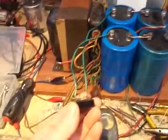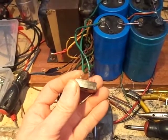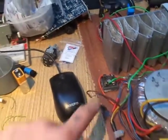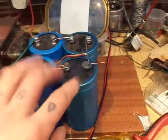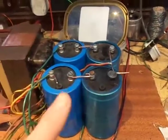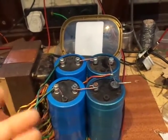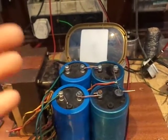I was wiring the bridge rectifier yesterday but I can't find any data on that one at all. It looks like it should do the job but I'm going to swap it out for the original one that came off the board — that's rated for 25 amps, so we should be good. Using a bit more capacitance than what the transformer is probably rated for, but because this is for a subwoofer we want plenty of stored energy — it takes a lot of power to move that big 18 inch woofer.